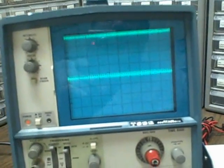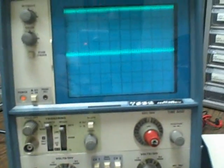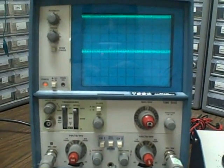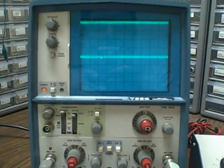We were able to calibrate and read the voltages in the proper divisions across the entire range. Next, we'll take a look at the frequency time base and check all of the time base settings.